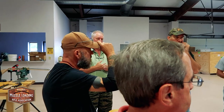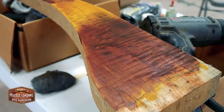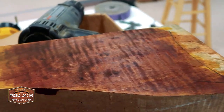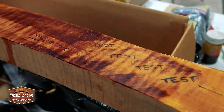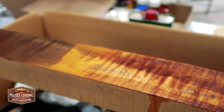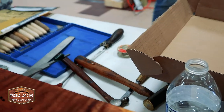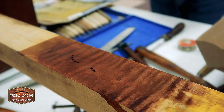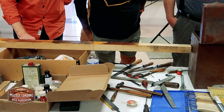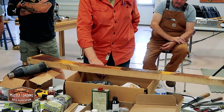You guys should aspire to do more of this kind of work. When you work your stock, you save a piece — you're going to have spare pieces, and those should be your staining practice pieces. Just keep messing around until you get a color you want. Sand it pretty well, similar to how your stock is finished before you start. You can get some rough idea with a rough-cut piece of wood, but it absorbs the stain differently depending on the porosity of your wood — sanding will make everything smoother and it'll look a little different. A rough-cut piece will still give you some idea of tone.